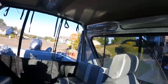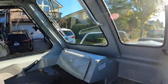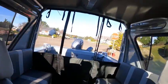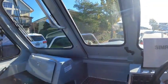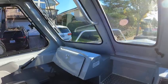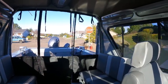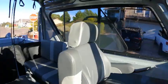A lot of people love these — they're very stable, very quiet. You really don't need trim tabs on here. Sometimes people use trim tabs but that drains a lot of fuel and you're working your motor. Sometimes it's good because people don't like to work their motors that hard. But after you get these broke in, I would say if you're just idling around at about 4,000 RPMs all day long and never goose it — at the end of the day, even that kicker motor, open it wide open for five minutes before you get back to the dock. Same thing with the kicker. Open it up wide open; clears all the carbon out and you'll have a good-running, easy-starting motor every time. This is a tiller motor — a tiller instead of a remote.